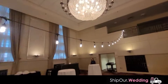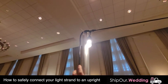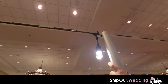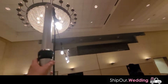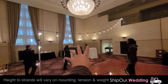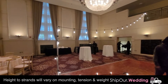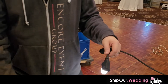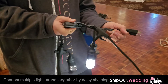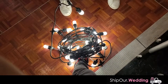Let's go ahead and mount the first strand. The string light is going across — it's attached to the top of the upright, just like you see here. We make sure to put two attachments on it so it's safe and doesn't come out. This right here doesn't look like it's at a good height, but going backwards with it you'll see it's about six to seven feet. What we're going to do is raise the upright after we have all the string lights attached. To get power to the second strand, you take it and put it in a soft knot like this — very easy. This will keep it together.